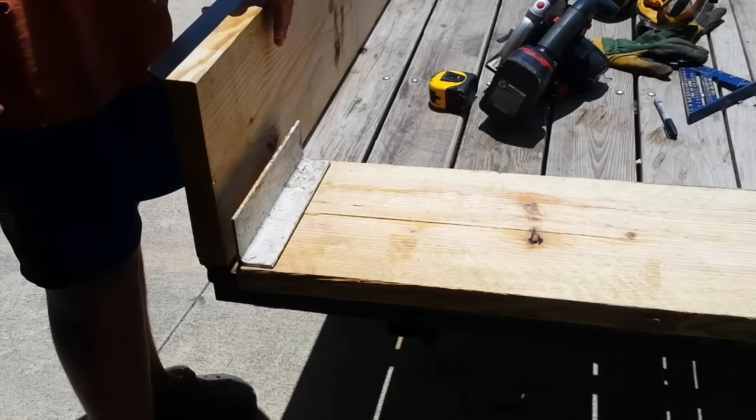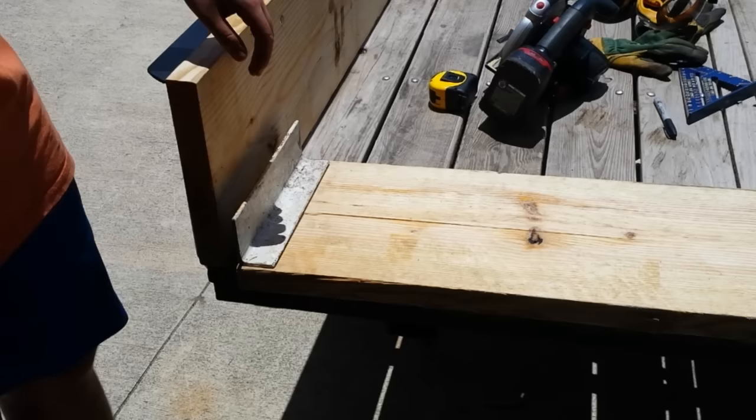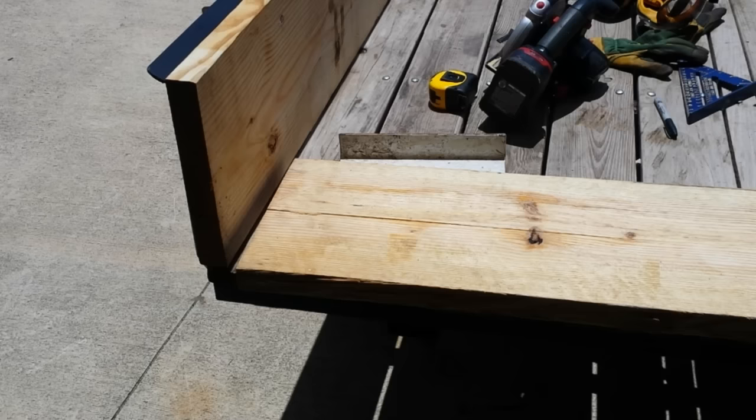So this is how it's going to be mounted — not to this piece, it's going to be mounted to this piece. I'm going to drill 3/8 holes here for some 3/8 carriage bolts, and that's going to be like that. Then I'm going to get a barrel bolt and drill a hole in the steel or the wood, wherever it ends up, and that will be used to hold this piece up whenever there's not dirt — just kind of lock it in so it ain't flopping everywhere. I gotta go get some bolts and barrel bolts.